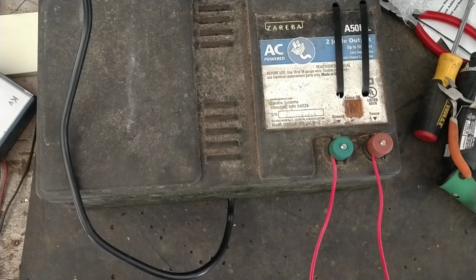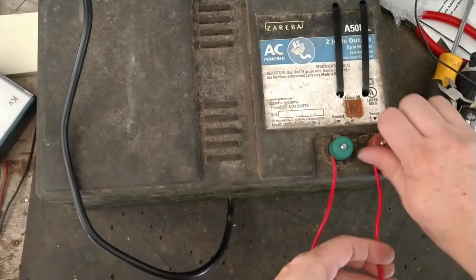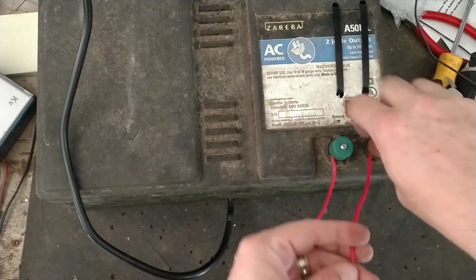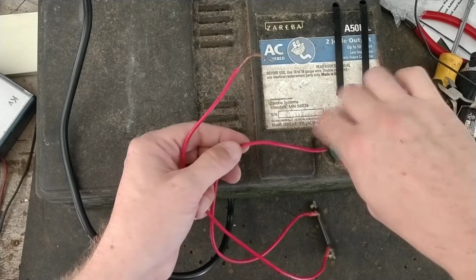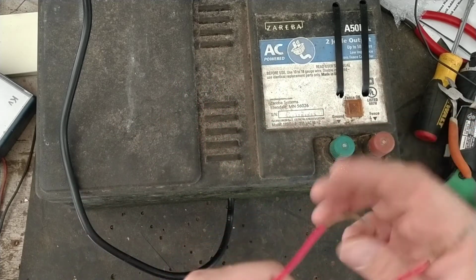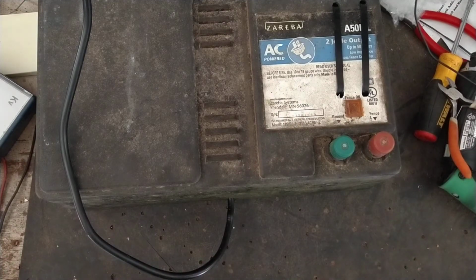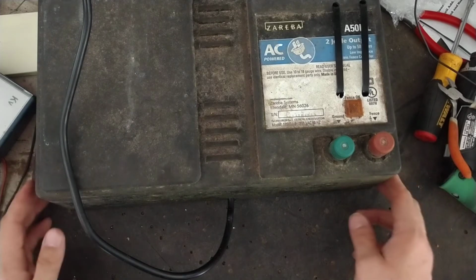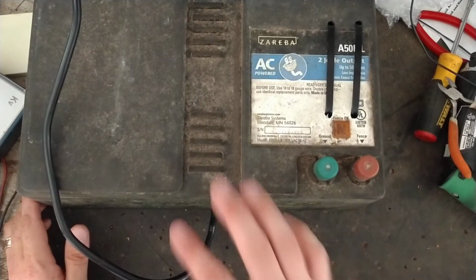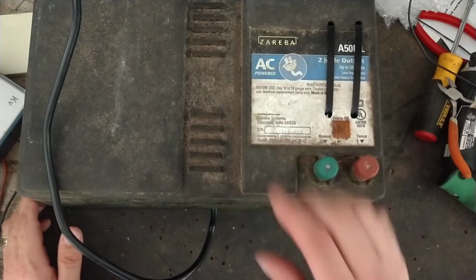All right, we always wonder if they're telling the truth or not. Well, it's a 2-joule unit based on the transformer that we have inside this one, and the size of capacitor that they're using in it. We could increase the joule output if the guy wanted to. The transformer we're using, we put it all the way up to our 10 joule unit, so maybe 15 joules. I mean, that transformer will handle a lot more power than what this unit's designed for.